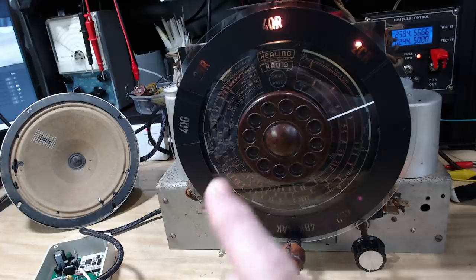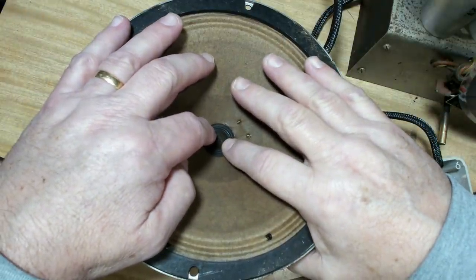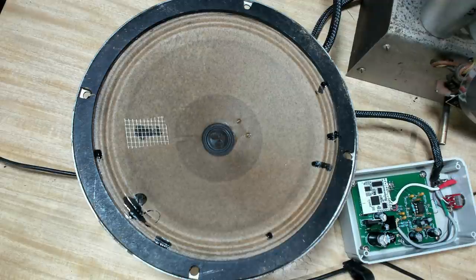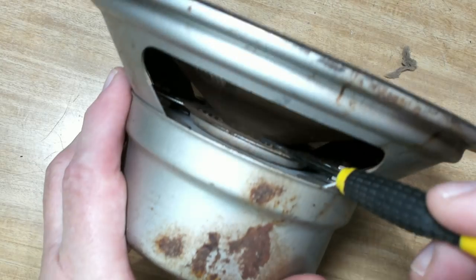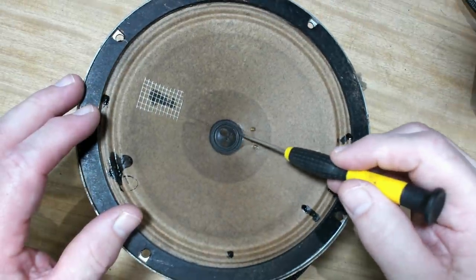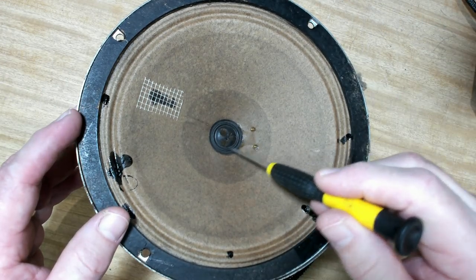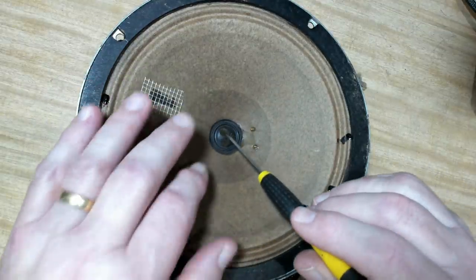Something I noticed while that was playing — there's a bit of scratching in that speaker. I'll move the speaker over so I can see it. It's just touching — probably got grit in there. They don't seal these as well as they do the modern speakers, so it's probably got a bit of grit behind it. I've cleaned out a lot of dust that was stuck between the spider and the cone, but it's still doing it. I don't want to pull this off — it'll be destroyed. The edges are still stuck down so I can't lift the whole cone out. I wonder if I blow some compressed air in there, it would blow air past the core and the voice coil and maybe just clear out any grit.